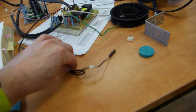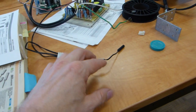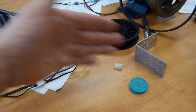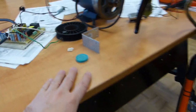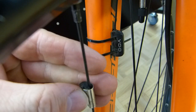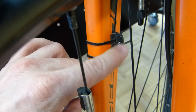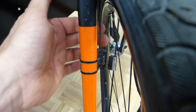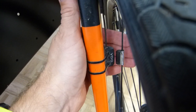But even so, the question of electrical suitability in terms of signal strength and everything, that's up to experimentation. But for what's involved in terms of securing the sensor to the frame, here are some options. On a bicycle here, this is why I have a bicycle here, you can see how this is installed in a functional order. On the spoke here is a magnet. Over here is this proximity sensor or speed sensor, either which way, and it has no moving components.